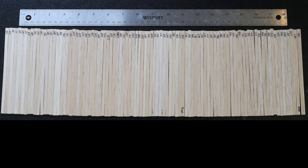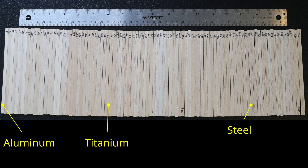The lightest one weighs 0.156 grams and the heaviest 0.734 grams. To put that range into perspective, if the density of the 0.156 gram stick was aluminum, titanium would be 0.261, steel 0.454, copper 0.518, and even lead would only be 0.656. Of course, balsa wood does not behave like all those different metals.